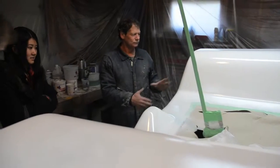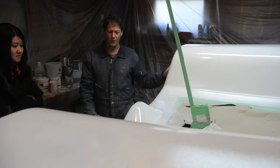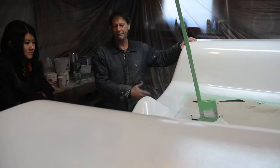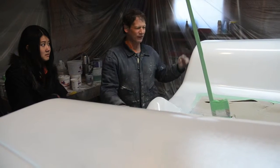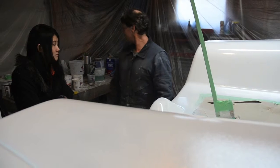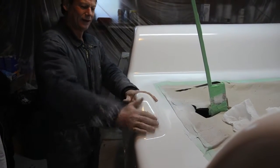The owner had sanded all the gel coat off of it and created pinholes everywhere. So again, I used the gel coat to fill holes, fair, and do everything. So this will buff and polish. You wouldn't believe it, but you can see the shine from the clear that's in it. If you see that at 3 in the morning, it's already cured.